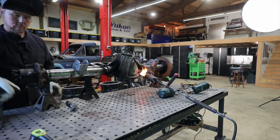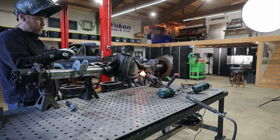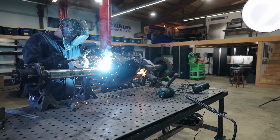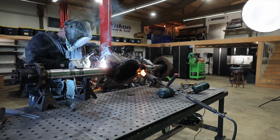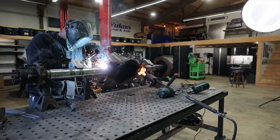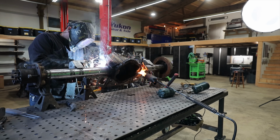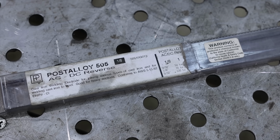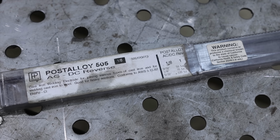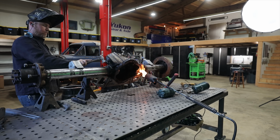And what I've done is I emailed a cast iron fitting company a number of years ago, and I got information on how they weld cast, and I just replicate that here in automotive. So I'm heating up the center section between 400 and 600 degrees. In this case, we're gonna be just under 500. I welded it up with a specialized rod that was recommended to me from this fitting manufacturer, and this stuff works really good, but you gotta hook it up in reverse polarity, and you gotta preheat everything before you use it.